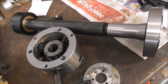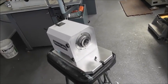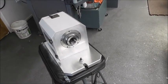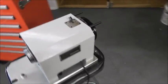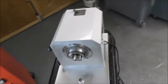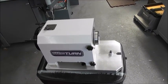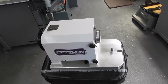Let's race through to the other part of the workshop. The headstock — again, beautifully finished. One thing that concerns me is that it's made of aluminium. I understood that when I bought it, of course. Aluminium is much lighter than steel and you can hump it on and off the machine more easily. But the coefficient of linear expansion is a lot more than steel — about double that of steel — and you've got a steel spindle.